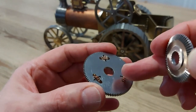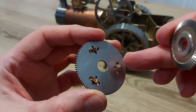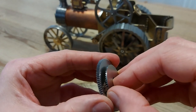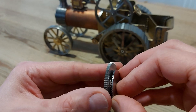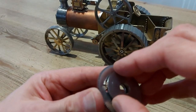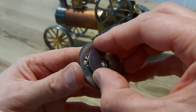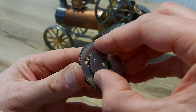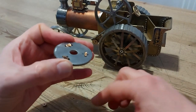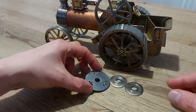I'm going to machine them again and make another set, and machine them twice to get a slightly thinner wheel there. But then they'll just more happily engage. And you can see there, if I just bring that down slightly, that engages very well. So it's just at that very uppermost diameter that it's struggling. A bit more work, but as you can see, we have all the parts of the differential.